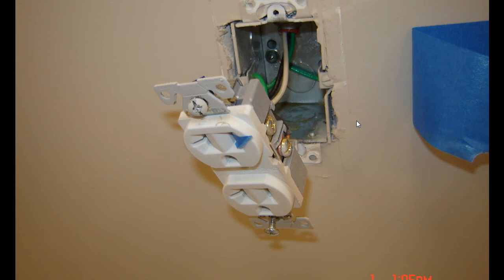Hello SparkySparkyOnline.com. Today I want to talk about grounding your receptacles in your boxes, and specifically coming from the 2008 NEC book, section 250-146, which states that an equipment bonding jumper shall be used to connect the grounding terminal of a grounding type receptacle to ground the box, unless grounded as in 250-146(A) through (D).